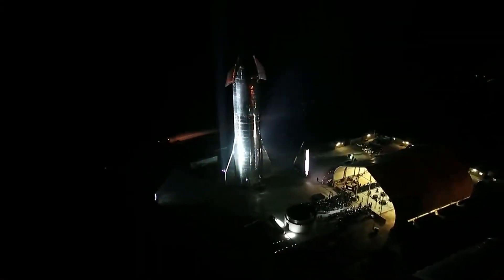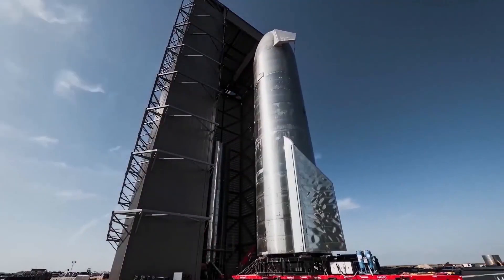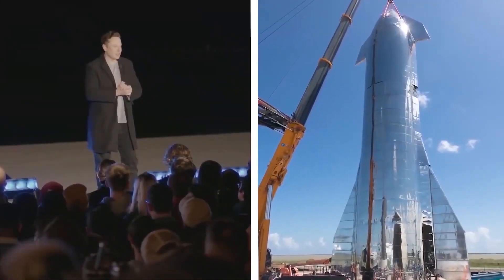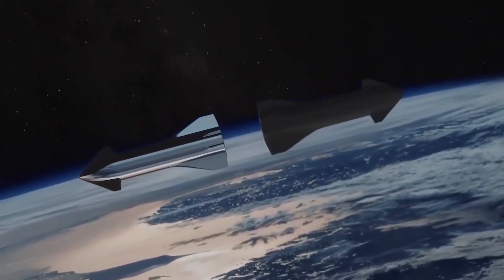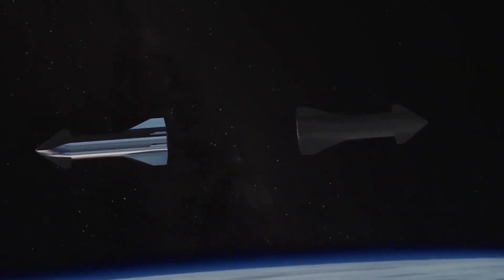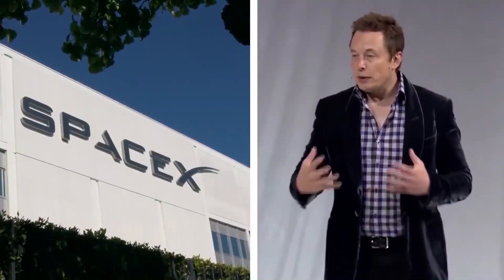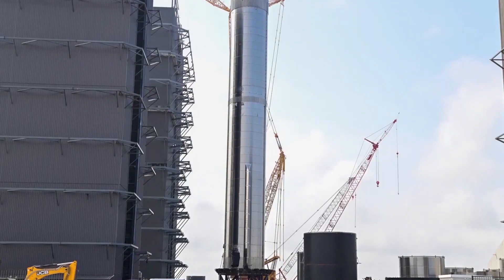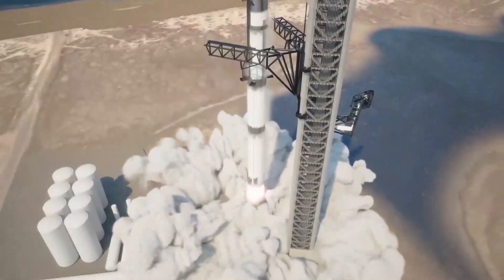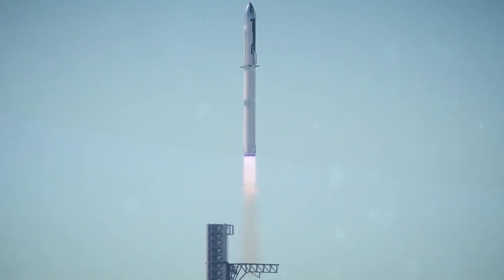The changes are simple enough. In essence, SpaceX will be adding an extra ring to several Starship sections. For current ships, six distinct sections are stacked to form Starship's cylindrical tankage and hull, and it takes another five stacked sections to complete the current nosecone design. With the design changes sketched out on a Starship S-24 ring and an upgraded nosecone debuting on the same ship, fully assembling a nosecone will now take two or three stacks, and fully assembling a Starship will take six stacks. These changes will significantly simplify, and thus potentially speed up, Starship assembly, with additional positive impacts on plumbing, wiring, and heat shield installation.